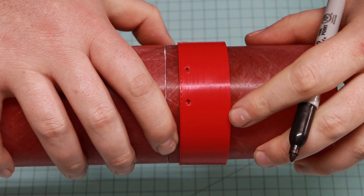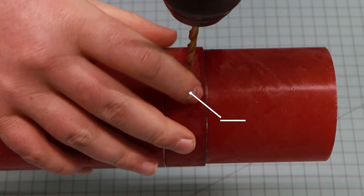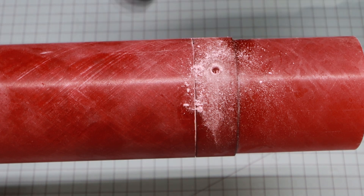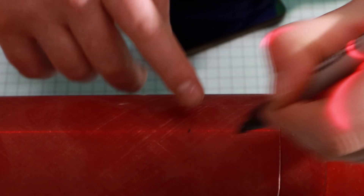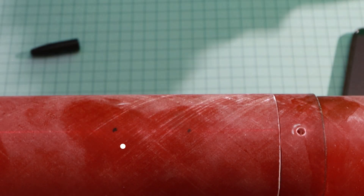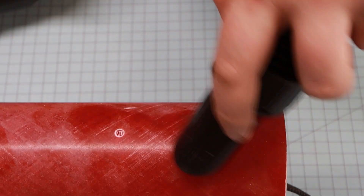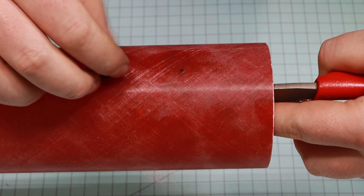I used my guide to mark three evenly spaced holes for venting the electronics bay. I used an online calculator to figure out how big my drill bit needs to be, and I always err on the side of larger rather than smaller for safety. Here I'm using a light to determine where my electronics bay ends, and I'm using a laser aligned with the rear rail button to ensure everything's in a straight line. The hole I'm currently drilling is for the forward rail button. I'm using needle nose pliers to align the weld nut from the inside while I secure the rail button.